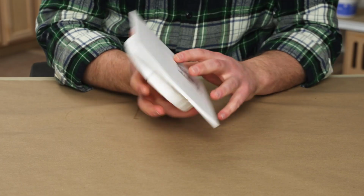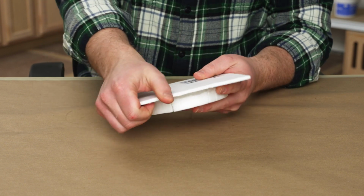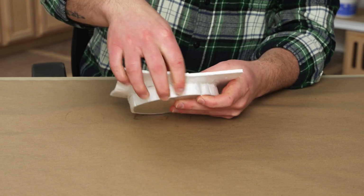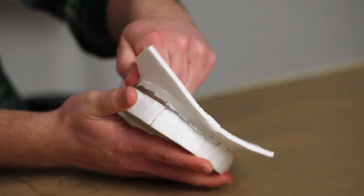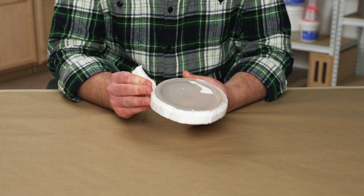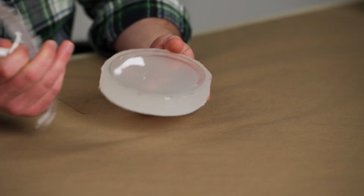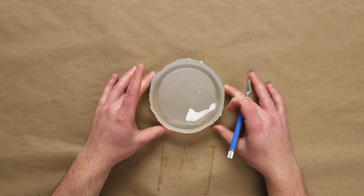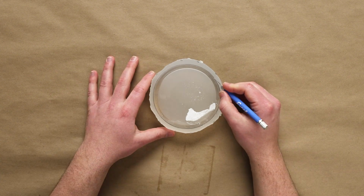The start of that process is removing our mold box. Turning our mold upside down, we can remove our base with some slight force and then tear away our mold box walls to complete this process. Our foam core mold box has served its purpose and we can discard it at this time. If we chose a more durable mold box option, then saving our material to reuse is a smart move. Although we used glue around the perimeter of our master, we can see that there is some cleanup we'll need to do before we remove our part.